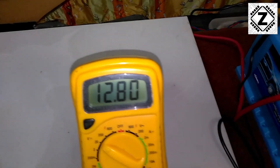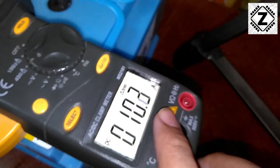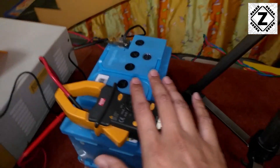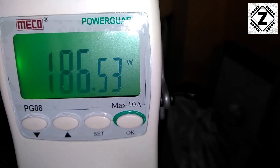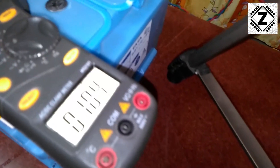The battery voltage has started climbing — it's already around 12.8 volts. The amperage is pretty constant at around 10.3–10.4 amps, so roughly 10 amperes are going to the battery. The watt meter reads somewhere around 186 watts. I'll keep observing and come back again after some time.